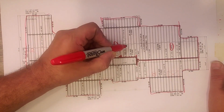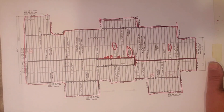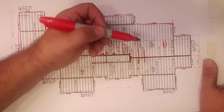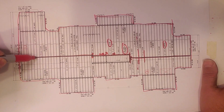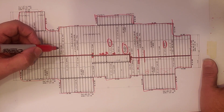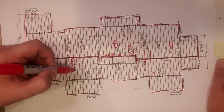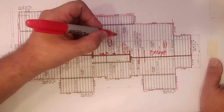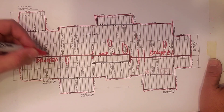Dropped means dropped below the floor framing; flush means flush to the floor framing. You can't see them here because I colored over them, but it calls out for joist hangers — each one of these joists has a joist hanger because it's a flush condition. When it's a drop condition, the joists either fly over the top or get broken on the center of that beam. Then we have the double lolly column, and that takes us to this condition here: dropped three-and-three-quarter by nine-and-a-quarter inch LVLs — dropped here, flush from there to there.